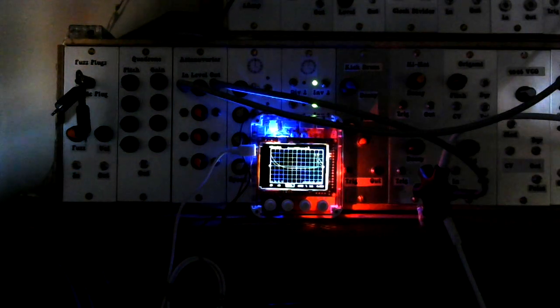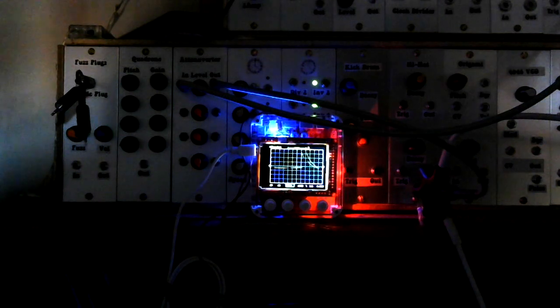And inversely, we are talking about inversions here, when I went the other way, because I had to open up the frequency in order for the inverted signal to close it down again, once I went back into non-inverting, we just got it coming through all the time because it was trying to open a filter that was already open.